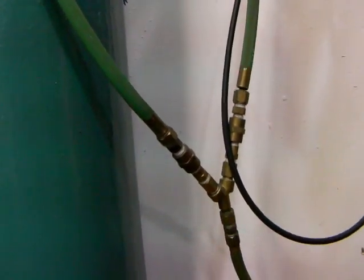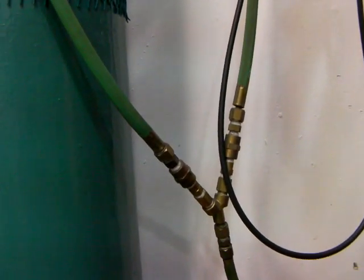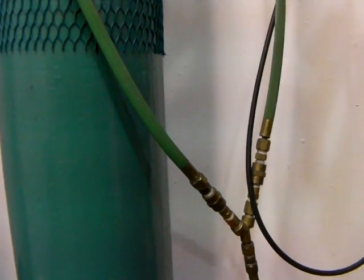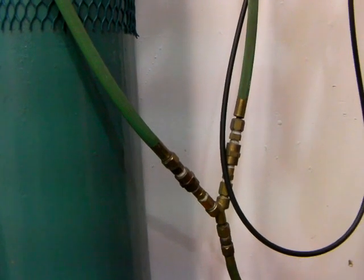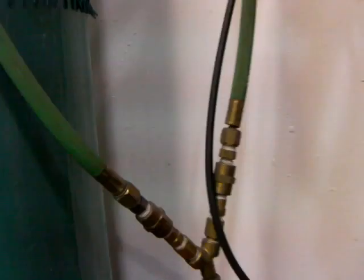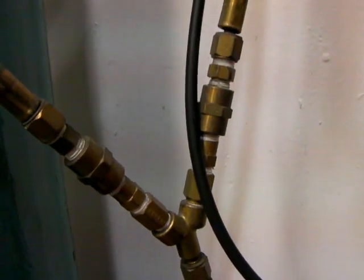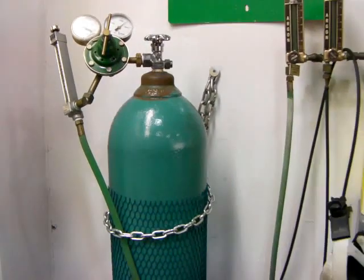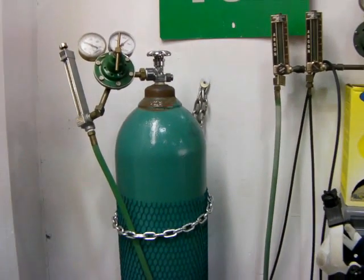How you do it: you get a Y fitting. You have to have a flow meter and a regulator on each tank. The hose coming out of the regulator, you Y it in from each bottle, and you need a check valve on each side so you don't mix your gases. It's just a simple arrangement. You can get one with valves on it, you can get a plain Y, you can rig something up, but it's better if you buy standard fittings.